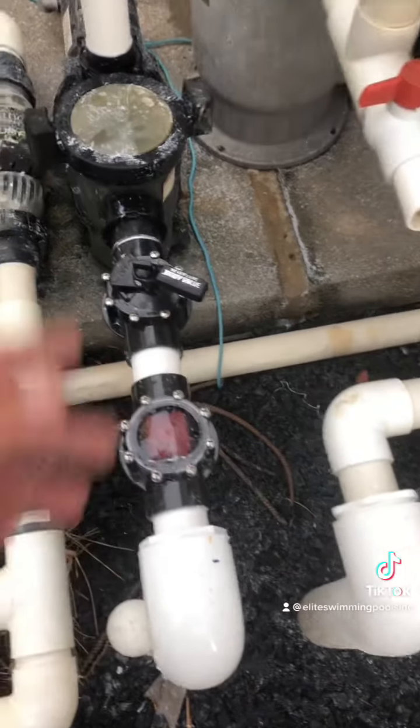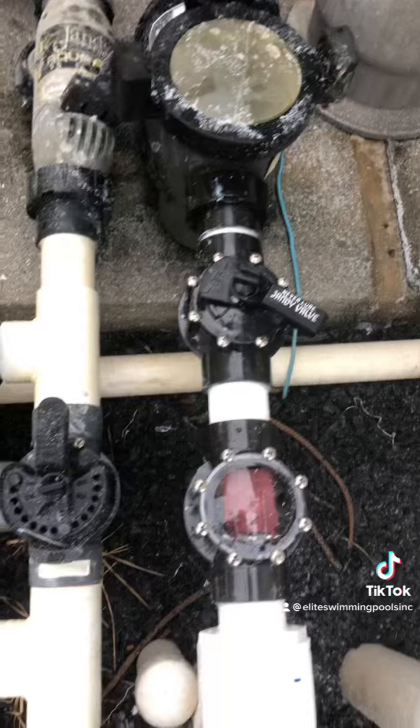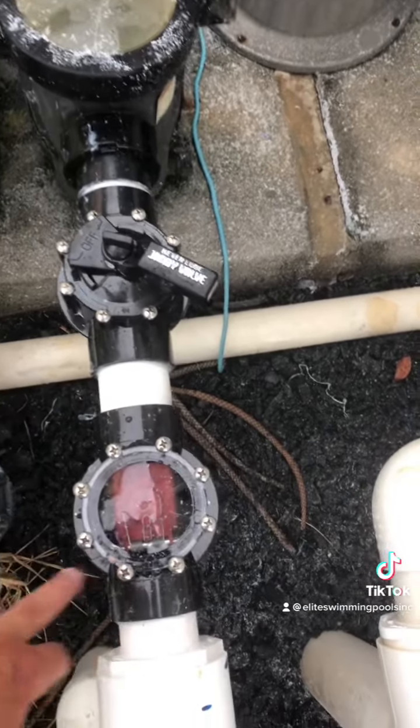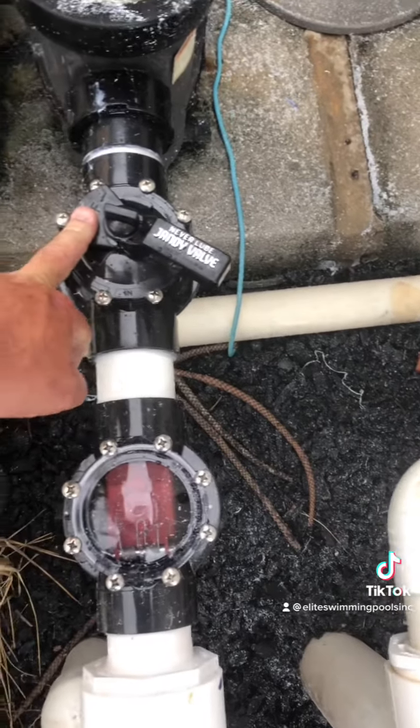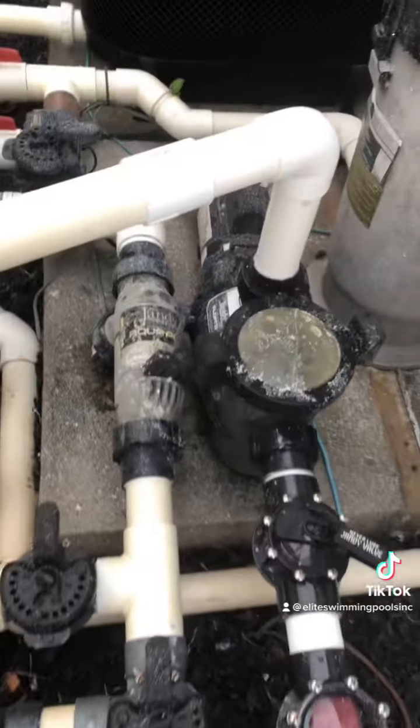It would empty the tank, burnt it all up, and you never had this valve here — so all the plumbing was burnt up and the pump was no longer catching prime. So we rebuilt the whole thing: new check valve, new flow regulating valve, new tailpipes. We plumbed it all up in here.